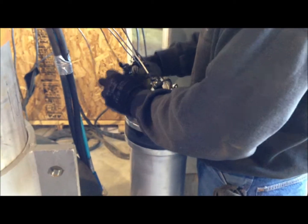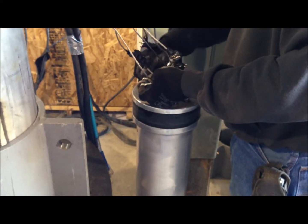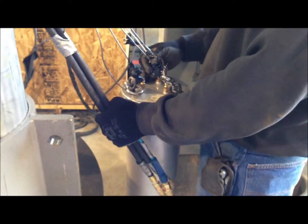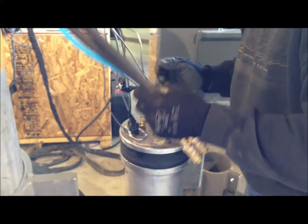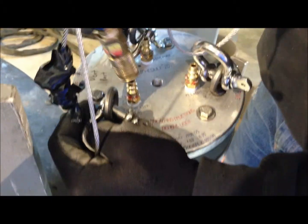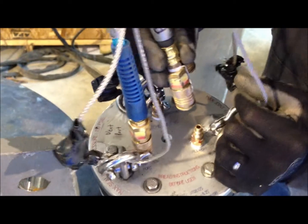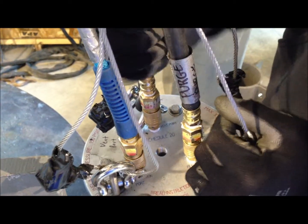He'll hook the cables to his left-hand side and put those onto the quick disconnects that go in there. Drew, explain which one's which. These are labeled seal inflation — that's what inflates the bladders. Then the fill port, which is where we purge through. And then the vent port, which is where we let the purge out.